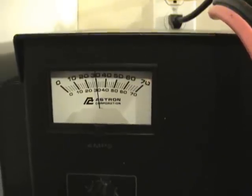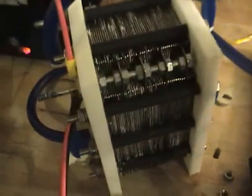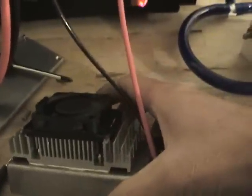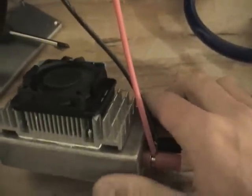Let's say you want to go to 30 amps — that's where you want to set your generator. Right there, 30 amps. This unit right now wants to pull 43 amps, but we've got it set at 30. The unit is handling it well. It's just warm, not hot.